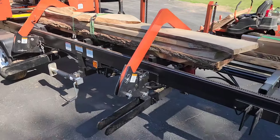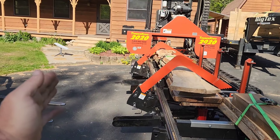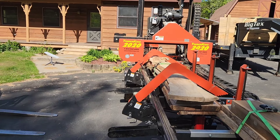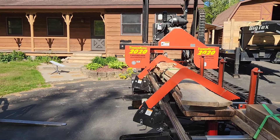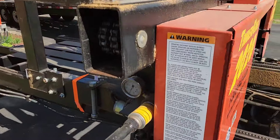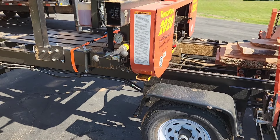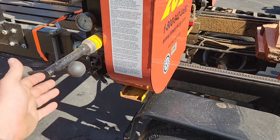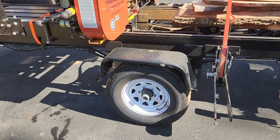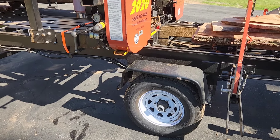When you're walking around the sawmill, you're going to have these arms here. Make sure the arms are slid in — the furthest appendage on your right side, as you're driving, is going to be that arm right there for the tensioning system for the sawmill. You want to make sure you have some pressure on that — we have it at 500 PSI — because if it was really, really loose, this could wiggle out while you're driving on the road. So just know that on your right side, this extends another foot and a half beyond the actual wheels. We went ahead and added air to the tires — recommend 80 PSI cold, we put 75 in there, which should be ample for what we need.